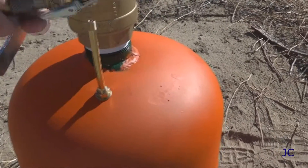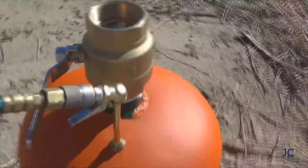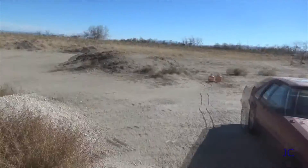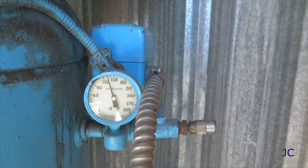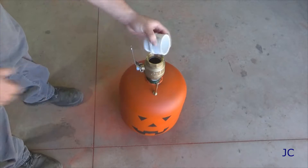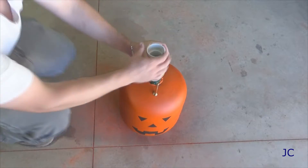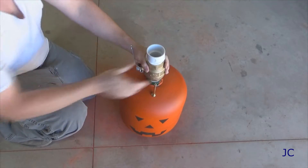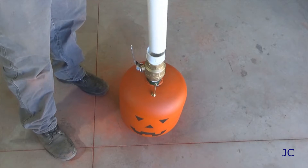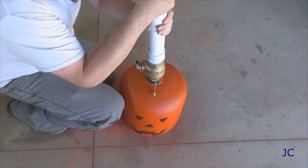We've got this thing mostly put together and at this point it's a good idea to do a little bit of safety testing. I've got an air chuck that I can lock onto the valve stem of our tank and I've reeled out as much hose as I can to get this thing out of my shop. What I'm gonna do is pressurize this thing to 140 psi - that's double the amount of pressure that we're gonna use to shoot it. Everything passed the pressure test and all we really have left is to install the barrel. I've got a male thread by female slip adapter that I'm gonna screw into the ball valve, and then we're just gonna take a piece of 2-inch PVC and install it into that - that's gonna act as the barrel for our candy cannon. It's important to note that I did not glue the barrel into the adapter. I wanted the barrel to be able to blow off in the event that one of our projectiles got lodged in the barrel.